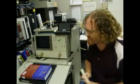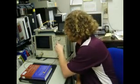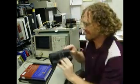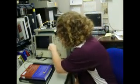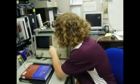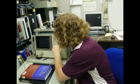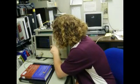To take a really good measurement, I need to do a calibration. To start this calibration, you hit the Cal key. I'm going to be using a 3.5mm calibration kit, and I can see it's already set up for the 3.5mm kit. So I hit the third soft button down, calibration menu, and I'm going to do 2-port full, which is the second from the bottom.